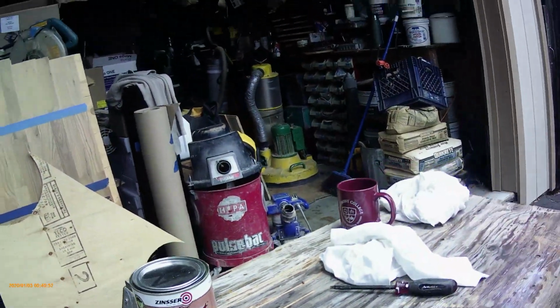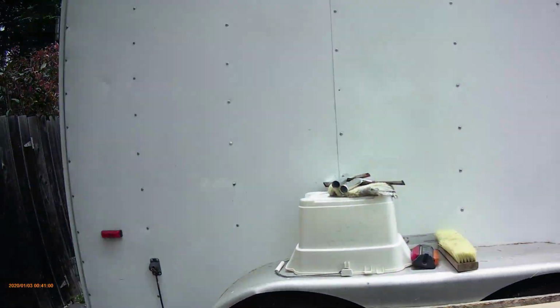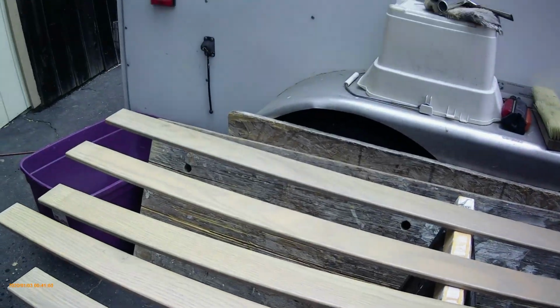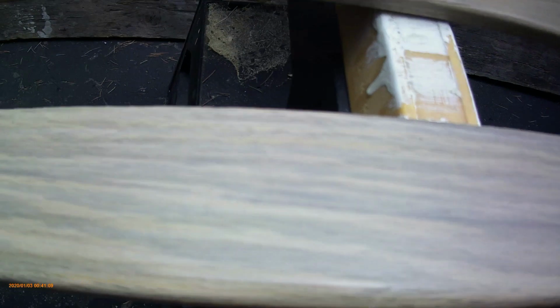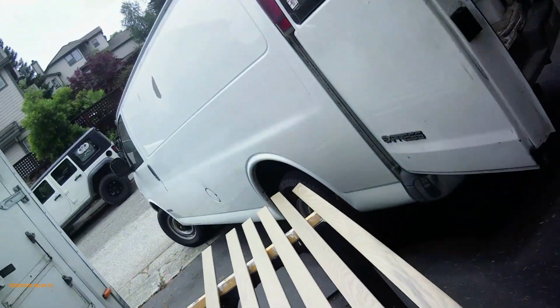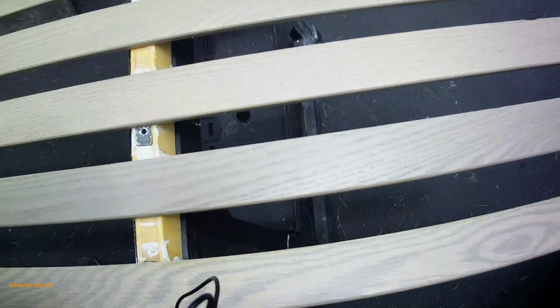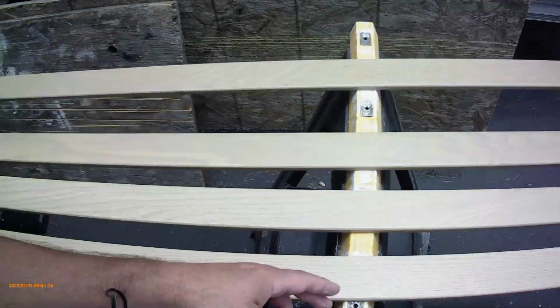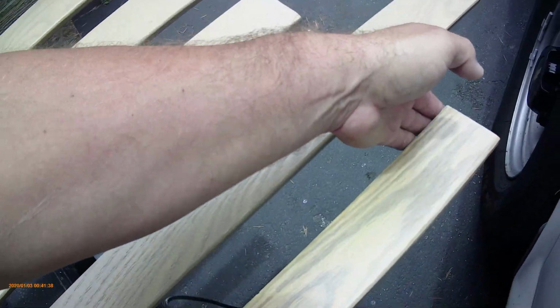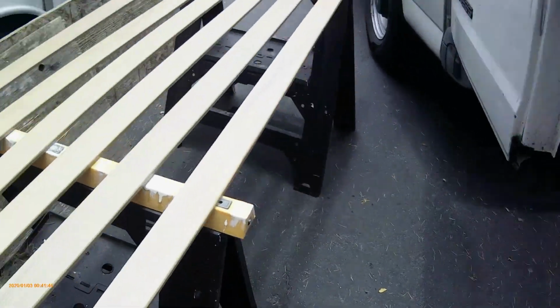There you go. I got them stained, a coat of shellac to bring out the yellow or the aging, and to turn the gray a little green. As you all know, as gray yellows, it turns green, and so here we go. Voila. Put a coat of the old base, which are dingy and kind of in between a matte and satin look from being beat up and stuff, and so I went with matte finish, and should work out okay. Get some of those drips from the back side there. So yeah, I'm happy with it.